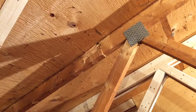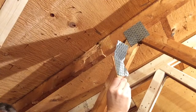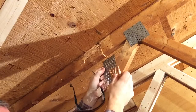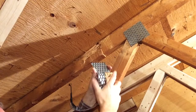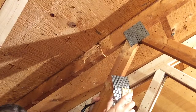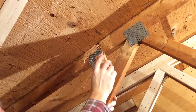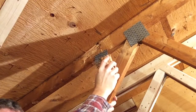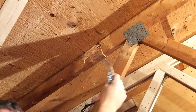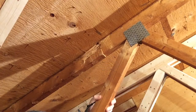It's completely fallen off - I found it in the insulation. Now it is possible to peel this piece of wood off, take this plate, and actually hammer it back in, but that's not going to help because it's just going to fall out very quickly. The effort of hammering stuff sideways against this truss is going to cause more issues than it can solve. So in this case, the connector plates are completely off - they're garbage and won't be reused.